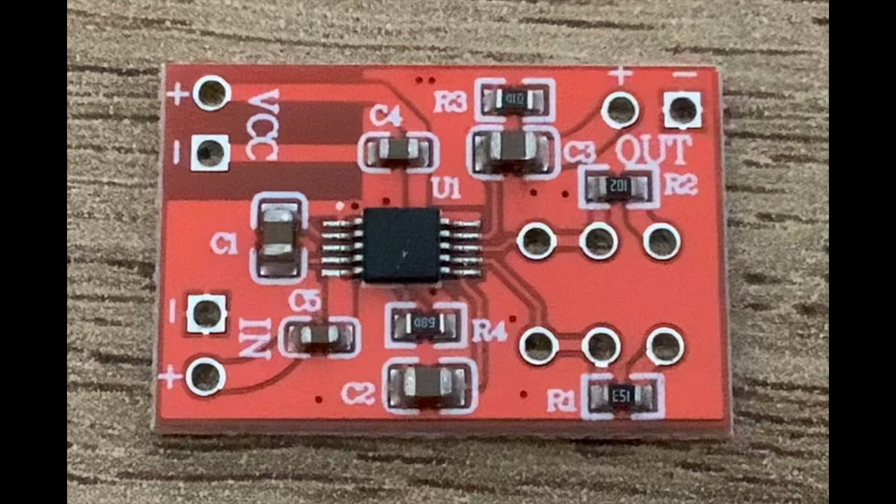So, just in case you're in any doubt about this, this is just a blow-up, really, of a still of that video I've just shown. And you can clearly see, I've got my big cursor here, you can clearly see now R1 and R2, and how R1 is connected here into pin 7, and how R2 is connected into pin 8. And now these resistors are soldered in the wrong way around. They're also soldered in upside down. That doesn't matter, but these numbers you're reading back to front and upside down, but that is actually 1, 0, 2, so 1, 0 and 2 zeros, so that's the 1K resistor, and this is 1, 5, 3, so that's 1, 5 and 3 zeros, so this is the 15K resistor.